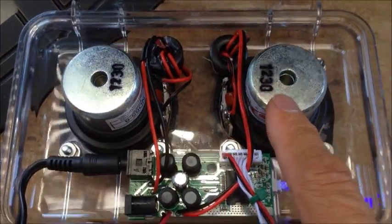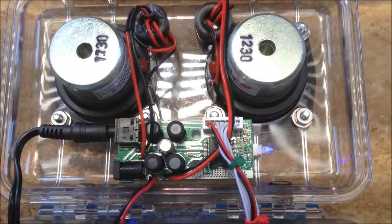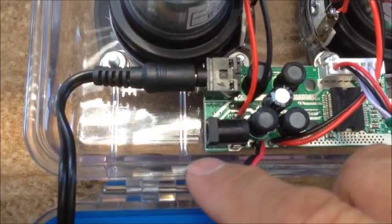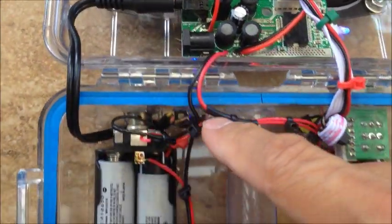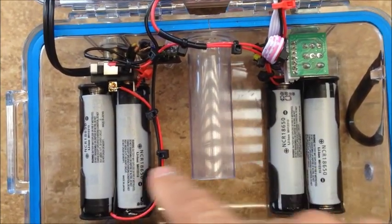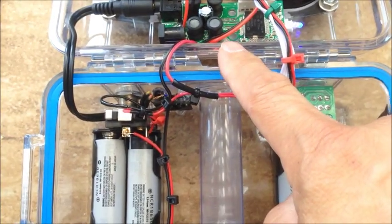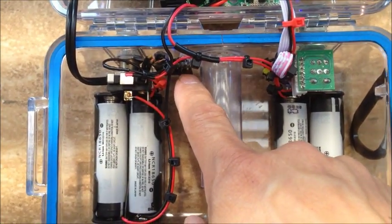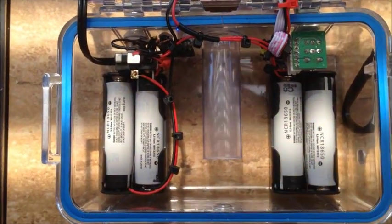The pair of 2.5 inch full range aluminum cone speakers are fairly self-explanatory — wiring comes from the printed circuit board directly into the speakers. There is an optional 12 volt power supply plug that you can wire in, but I've opted to solder directly from the three batteries in series for 12 volts for the t-class amp. Then the single 3.7 volt battery is good enough to power the 5 volt Bluetooth module, as its range is about 3.5 to slightly over 5 volts.